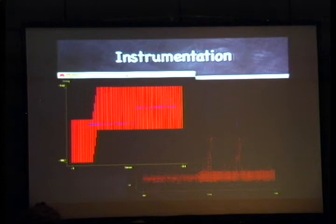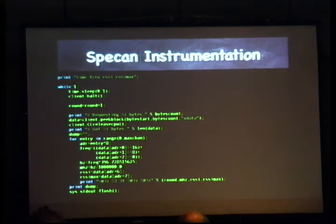We used Python code earlier in the lecture, and I'm sure some of you are confused — thinking you've read 'real men don't program in Pascal,' so how is Python manlier? Well, we've decided Python is manly if it has a healthy dose of pointer arithmetic. This code — and I've got a simpler form on my blog — basically yanks out all of the table and processes the C structure by pointer arithmetic within Python. This is almost everything except import directives: all you need to use the GoodFET library to dump external memory, find the structure of channels being received, parse it, and dump it as a text file to be processed by NASA's tools.